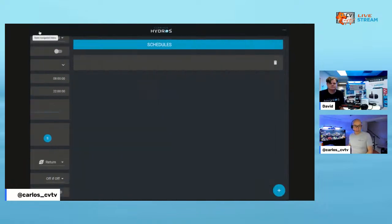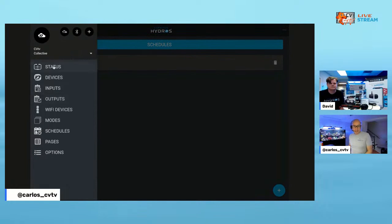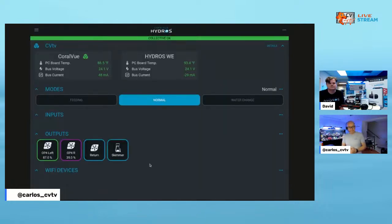All right, done. Let's go back to the status. And look at that. There you go. My OP4 left and my OP4 right are running now. So as you can see, before, when I had just defined the pumps, they were at zero. They didn't know what to do. I didn't tell the controller how to do it. It's a computer, guys. A computer will only do what you tell it to do. A computer will not make any assumptions. So in this case, once I defined the schedule and told it which pumps I want, then the pumps started running.